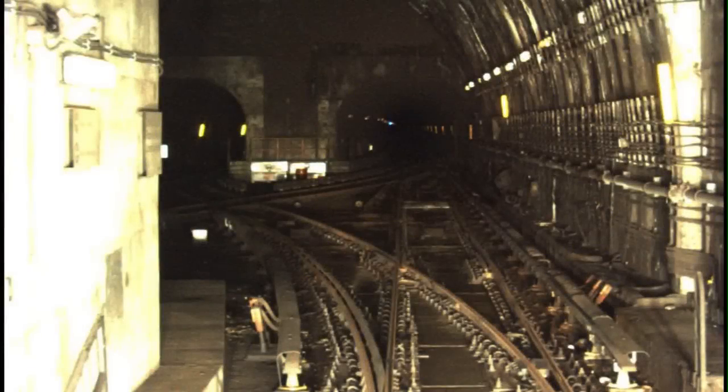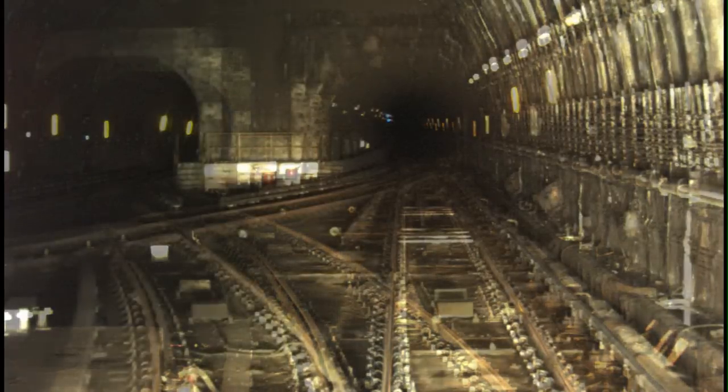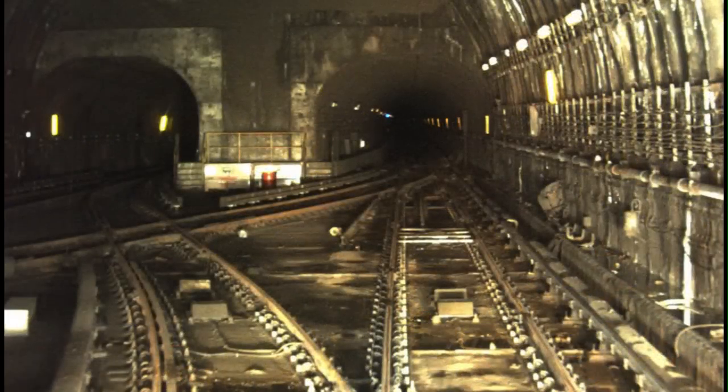The interlocking at Medical Center is fraught with problems due to water infiltration. The water corrodes the rails, causes arcing insulators, and mud buildup prevents the switch from operating as it should.